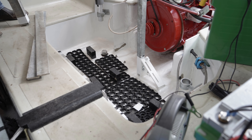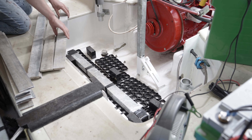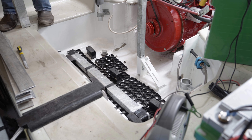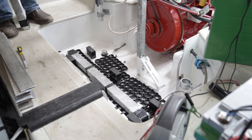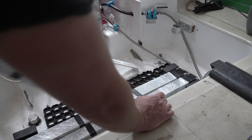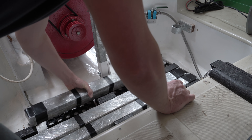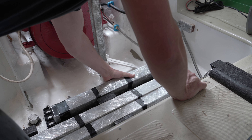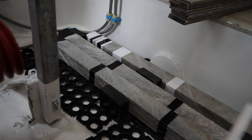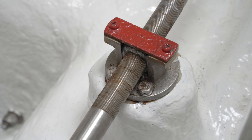The massing is more or less ready, and I've taken care to protect bolt heads and shanks so that there's no damage from metal-on-metal friction or point loading of the weight on things liable to break. I tentatively began placing these larger bundles of ballast, and since the glassing work from the original boat build was robust but not too uniform in terms of shaping and finish, lumps and bumps mean I have to play it by ear as to how each bundle packs in. The battery box is going to end up being mounted on top of here, but I'll be having separate anchoring for the around 200 kilos of ballast and the 200 extra kilos of batteries on top. We don't want nearly half a ton of dead weight going on an excursion around Alan's insides. The final securement and next stages of ballast further to the bow will come later. For the sea trials I'll strap down all the spare bars on the base of the fuel racking, as we don't want to be down at the stern.